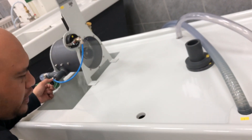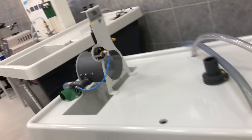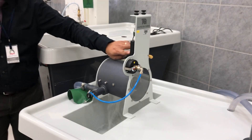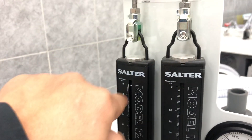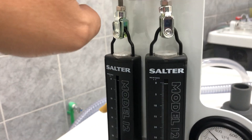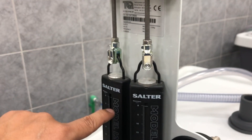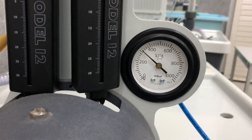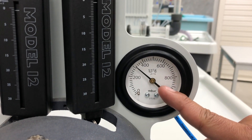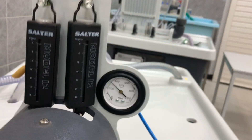At 100% opening of the valve, we can measure the speed of our turbine. With no load, the left and right spring balance will be on zero. We can adjust the load by adjusting the screw at the top. For the first trial, take the reading — left and right balance will be zero. The pressure of our water at the inlet is 300 millibar at full speed and full opening of the spear valve. This is our reference point.